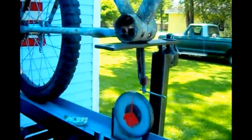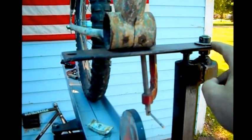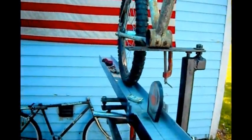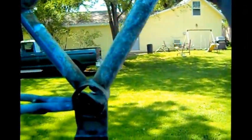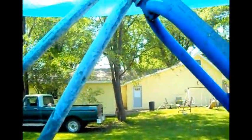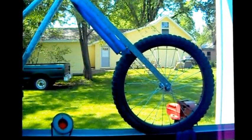This is how I made this on my jig — it was kind of thrown together, crappy welds. You've got a bolt here to adjust this up and down, so this plate goes up and down to tighten it. I clamp it on here, get it somewhat centered and level. This is an angle gauge — if you put it up here it would be 55 degrees. That's what I like — what they call the rake. I like it at 55 degrees. If you get this out too far, your forks get too long, and then it's not going to be fun or easy to ride, because you want a kid to be able to ride it.